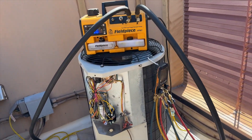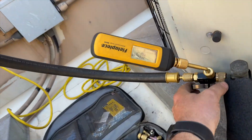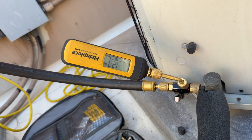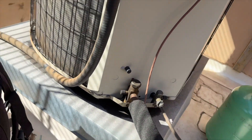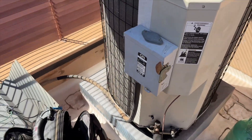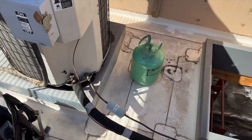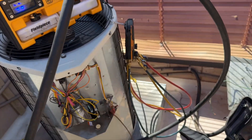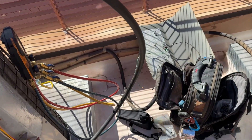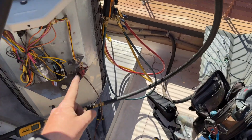We're back — it's after lunch. We're at 105 microns, about 120-130. We're going to call it good. We'll get our refrigerant tank set up, purge our lines, and charge this up. I know you're saying, why are you using R22? Just put in a drop-in. Drop-ins suck — this unit is designed for R22, that's what goes in it. I try not to use conversions unless I absolutely have to, and the customer agreed to use R22. Let's get set up. We'll start with the liquid line, zero that out, and we're going to have 4.88 pounds. Here we go.